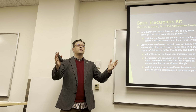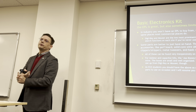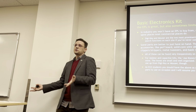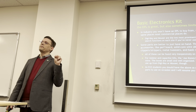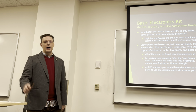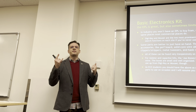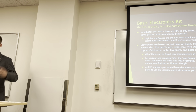So I'm going to give you a schematic and say, here are the parts you'll need. You should be able to pull out which parts you need. Mostly, it's going to be 3904s. You can use the MPQs, I recommend them, but it's not as crucial this term as it was last. It wasn't even that crucial last term. Everybody used it, that was fine. But they are a $5 part, and you'll need at least two of them, so you'll need at least eight transistors, eight 3904s, and again, if they're all matched, that's nice. There's a bunch of pairs that get loaded around when you build a Gilbert cell. If you build a Gilbert cell, which you will, it's the first part of the project, it's three matched pairs to build a Gilbert cell. So if you have two MPQs, then you have all those parts.